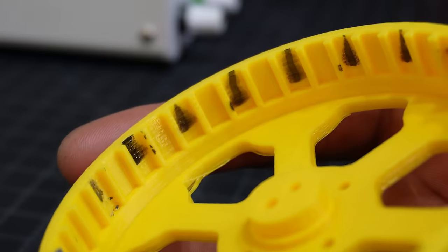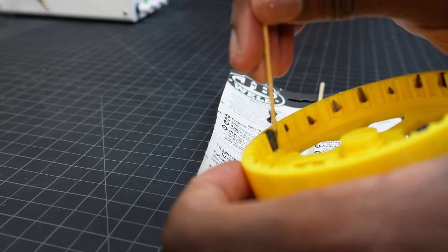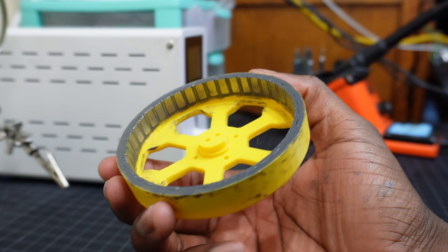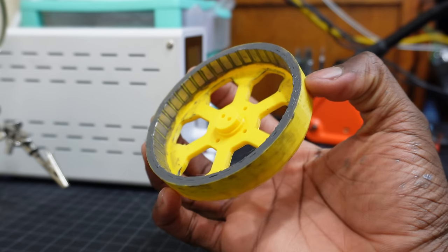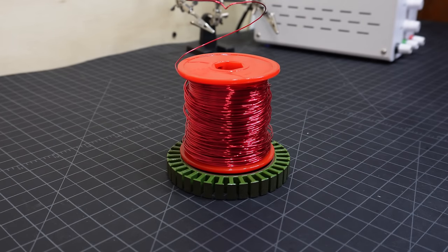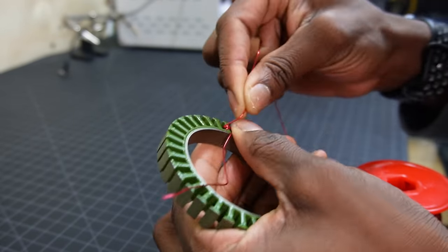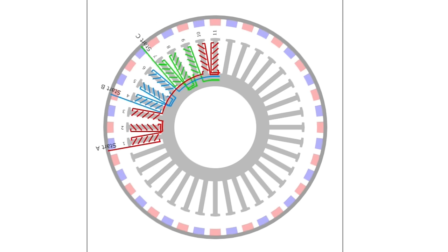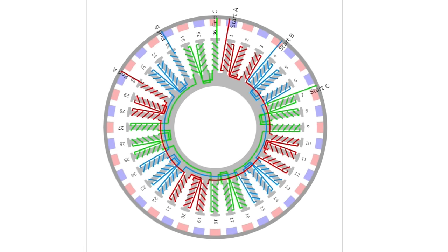Something that I found out while gluing the magnets is that JB Weld is 11% steel, which means that it should actually enhance the motor's performance, though probably not by a lot. I'm going to be using 22 gauge enameled copper wire to wind the stator. These windings are done in a specific pattern depending on your slot and pole configuration. I used this website to figure out my winding pattern, which I'll link below.